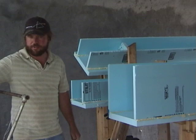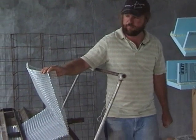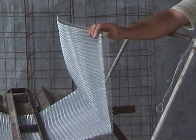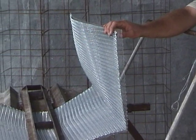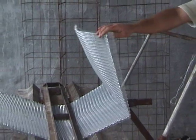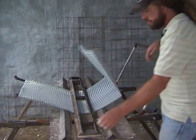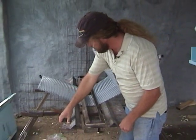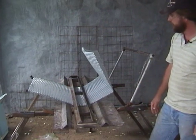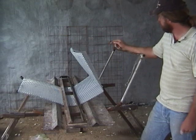When you do two layers of this lath, it's pretty strong. It's very similar to pre-tensioned rebar. They use this technique to build boats — ferro-cement boats — and we're doing something new here. This is the folder machine that we fold the remesh baskets on. It's got these movable wings here that are simply hinged, and we've got some broad adjustable legs that help keep it stable during production. We can produce about 63 of these baskets.